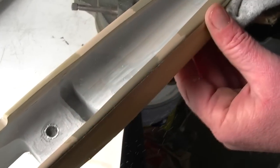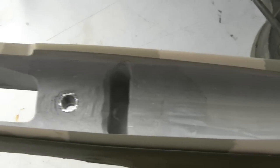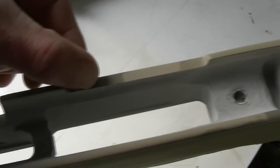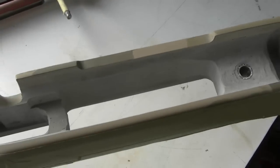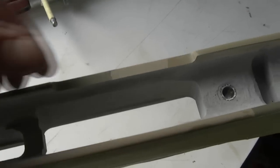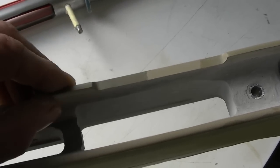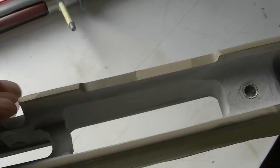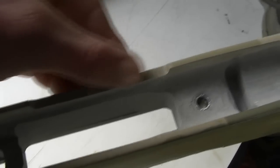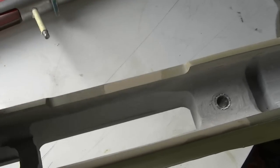That line is coming down nicely and it's clean through there. One thing you'll notice is that we had no insulation tape or aluminium tape along the top of the action. If you're a user with fairly low confidence, you want to tape everything up first through here so that if you're working with power tools and they run over, you don't damage your stock. Steph hasn't done it because she's quite confident with her power tools. But if you do run tape over the top during your work, make sure you remove and reapply fresh clean tape just prior to bedding.